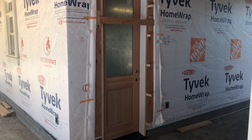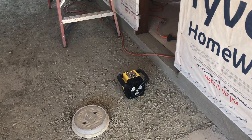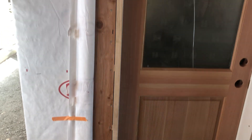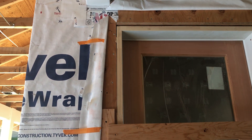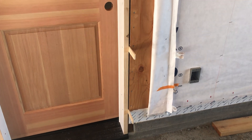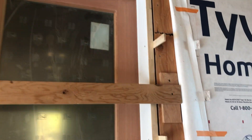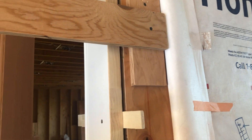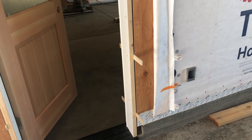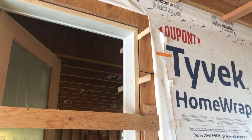I'm actually working on setting the doors. Here's the laser that I use. I line up this side and make sure that it's plumb. You can bend this frame very easily once you've put in a couple of pieces — I've actually forgotten what they're called — anyway, once you get the bottom and the top set, you can actually open the door.